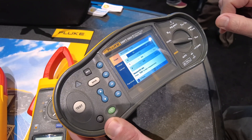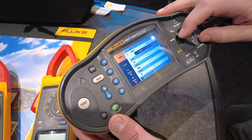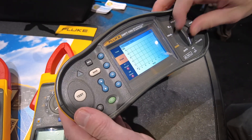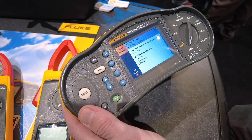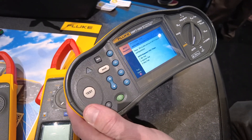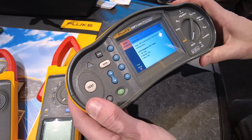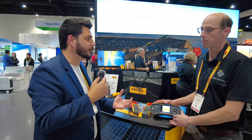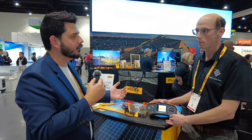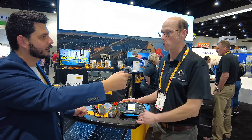How does the tool help determine if a module's rate of degradation exceeds the warranty? The SMFT-1000 also does an IV curve test, which checks the module to make sure it's working to the manufacturer's specifications. It's one of the few tests that can find problems you can't detect with just voltage or current testing. You can actually test a whole string of modules, not just one at a time, which is useful for troubleshooting a bad module. It won't pinpoint the exact location, but splitting strings can help identify it.